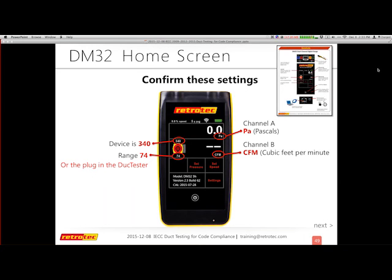The reason it's blue is so that you can easily identify it before you leave the house. It used to be white, and people were leaving it on a few registers because they looked up and didn't realize that it matched the ceiling. So it's now blue, so it catches your eye as you leave the house.